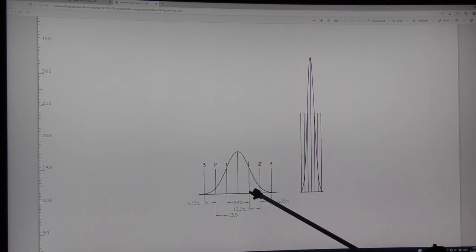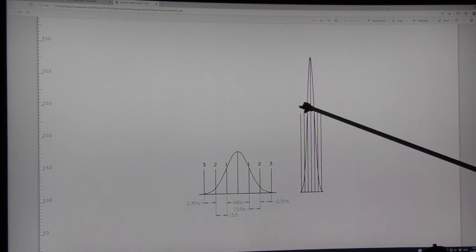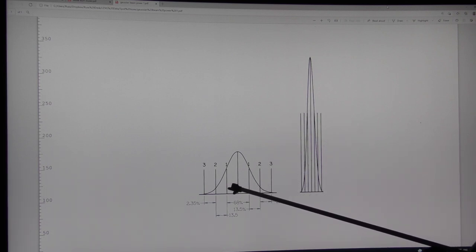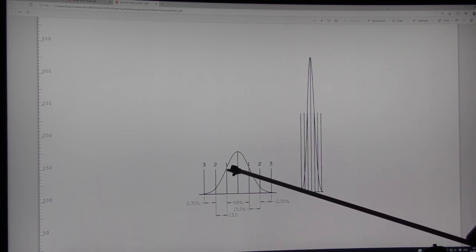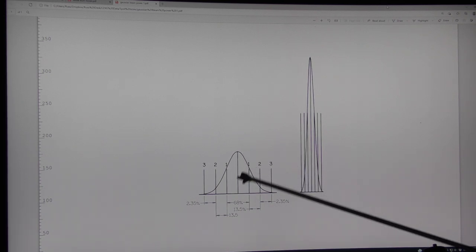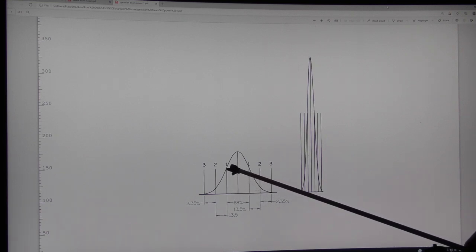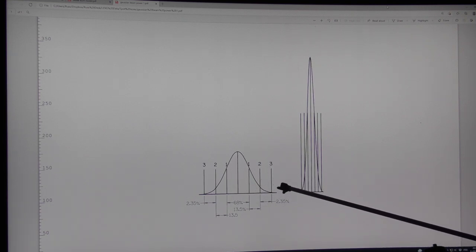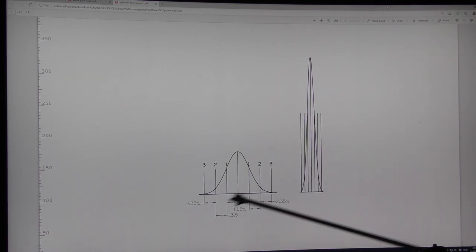The central 2 millimetres of the beam contains 68% of the power. Okay? Now, it doesn't necessarily contain 68% of the intensity, because the intensity is nothing to do with the power. The power creates the intensity, because look, the intensity goes much higher than the power. So 68% stops there, but the actual intensity is a scale up this way, measuring the height of the graph.